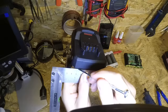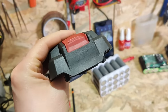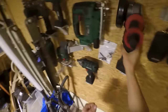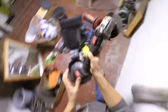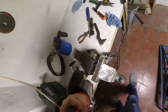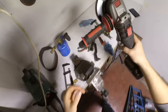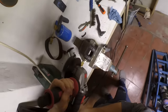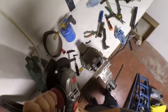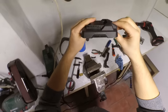The first thing we'll be doing is marking a line on the little extra plastic bits that stick out on both sides. Next we remove the button — we won't be needing it now; we'll deal with it later. Using an angle grinder, I start cutting on this line. There are bits of molten plastic to remove. That's pretty flat — not a hundred percent perfect but it'll do. Next thing is sanding paper; the whole top part actually needs to be completely flush with the surface.